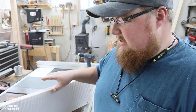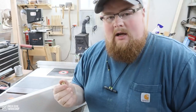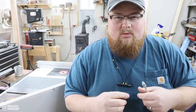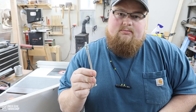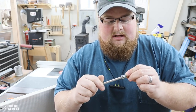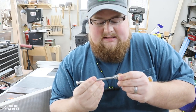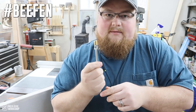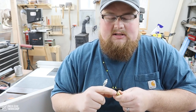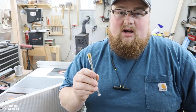I'm going to put a threaded insert in the bottom of this light panel so that I can attach it to some tripod mounts. I'll put a link to where you can buy these online in the description below. A little trick I found for the most reliable way to get these in is to take a bolt that's the same thread — in this case, a quarter by 20 — stack some nuts on there so it only goes so far, and thread it in. That gives you a much stronger, better way of threading this into the wood. These come with little slots, with the assumption you'd use a screwdriver, but it's horrible — you can't line them up, they keep falling out, and eventually you'll strip the brass before the insert is in. This trick is something I've used a lot and it's super helpful.